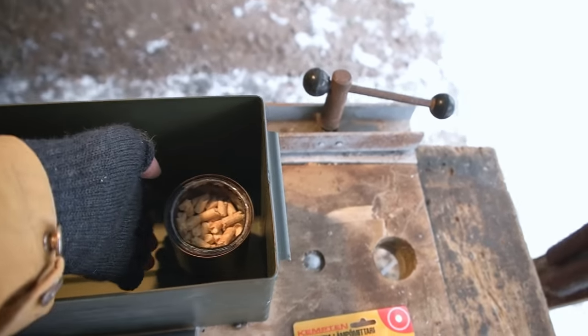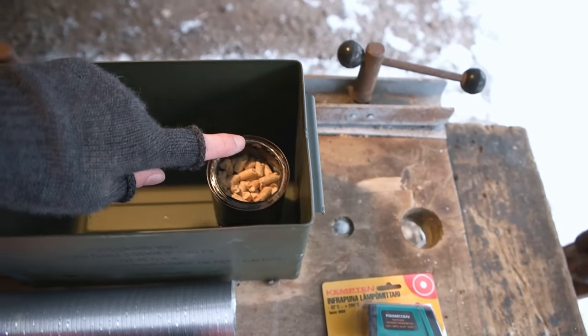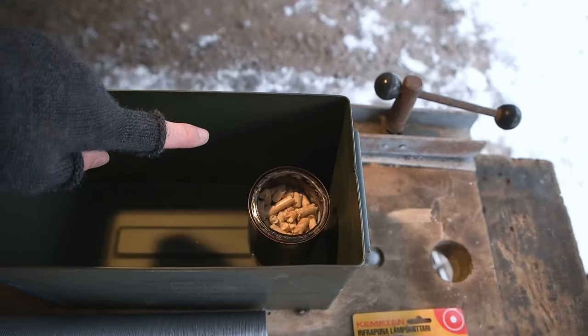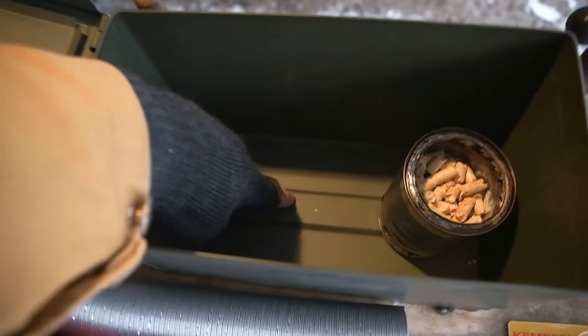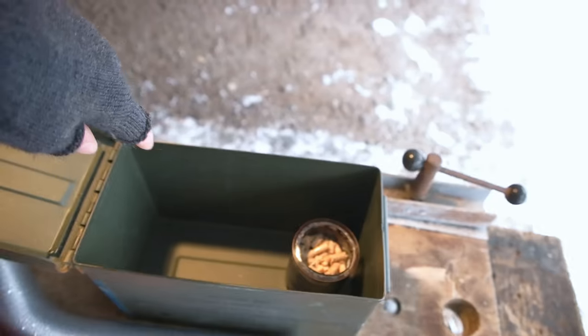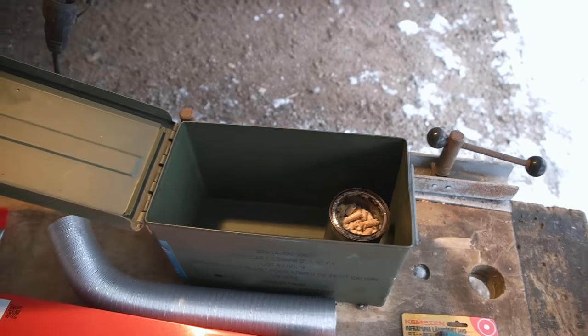I'm gonna weld that, make slices of that. I'm gonna make like inner, like baffle wall, what do you call it, here, so the hot air and the flames also, they're gonna come here. Then they are forced to go down. There's one wall over here, another wall over here, and there's a small gap on here, so it can go under that wall. And then it comes up, and I'm gonna put the flue pipe coming from somewhere here, on the side. So that's the plan. First, I'm gonna make the hole for the flue.